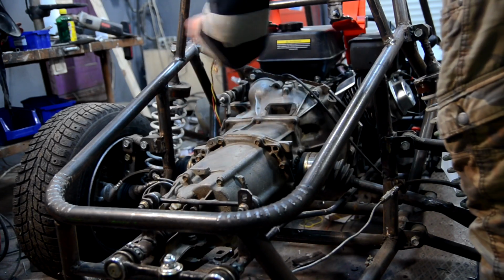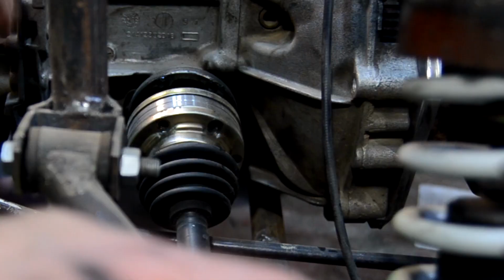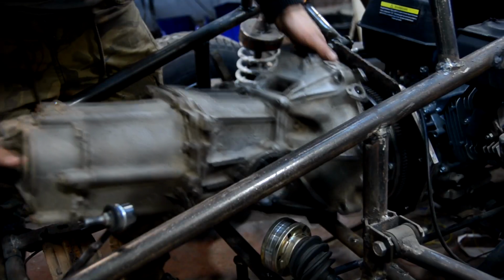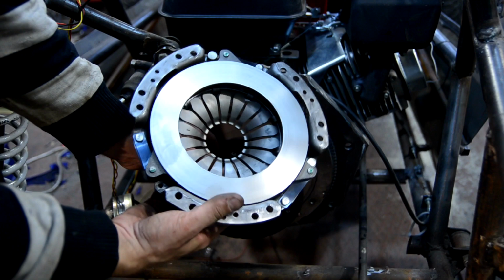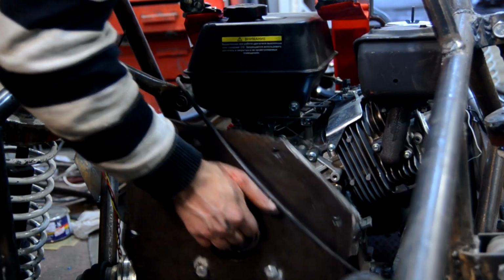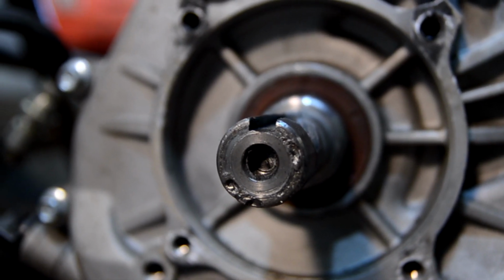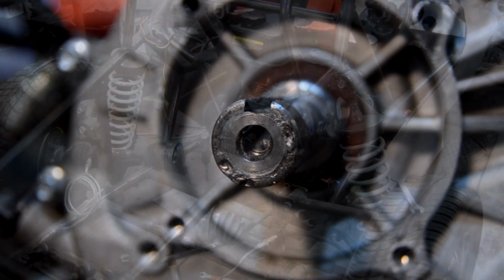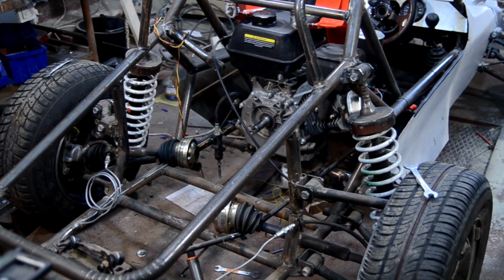Luckily it wasn't difficult to remove it, and I thought that I'd just grind out a new spline and make tests again, but it didn't work like that. As I made the transitional coupling almost by eye on a bad lathe, it had a backlash on the engine crankshaft axis. Due to this the bolt got broken and a key slot was smashed. It made me upset, but it is difficult to make such a project without mistakes. I'll think about it further. Most likely it can be repaired, but I need to grind out a new coupling on a new normal lathe and try again. All this you'll see in the following parts, of which there are actually not so many left.